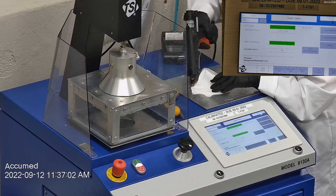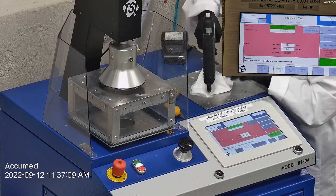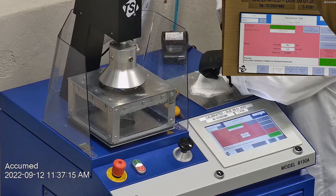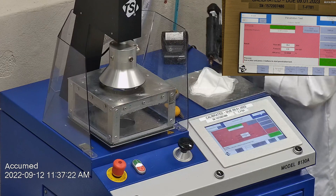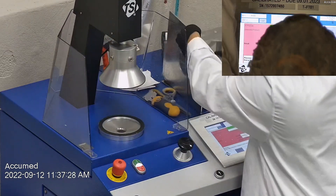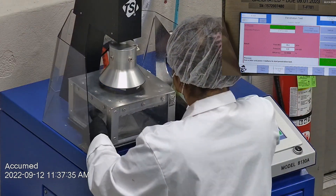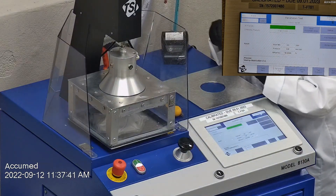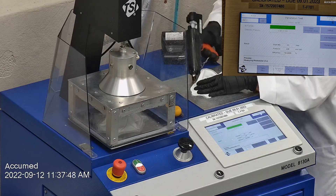We make sure that the mask is properly and completely sealed without gaps to the testing plate. When applying the hot melt glue, we make sure there are no holes or leakage around the seal to ensure accurate results. The testing plate is then attached to the frame and the box is placed under the TSI filter holder for testing. The results are displayed on the TSI monitor. F stands for airflow rate, which we test at 85 liters per minute. R is for resistance, also referred to as pressure drop — this correlates with breathability, so the lower the number the more comfortable and breathable the mask is. E stands for filtration efficiency percentage.